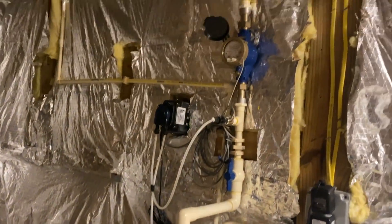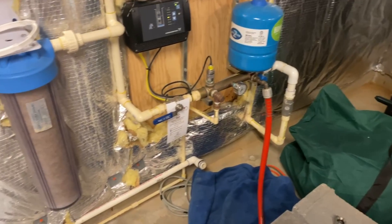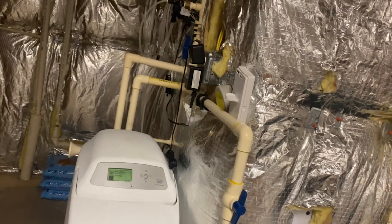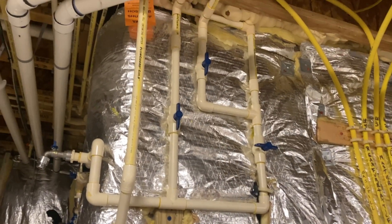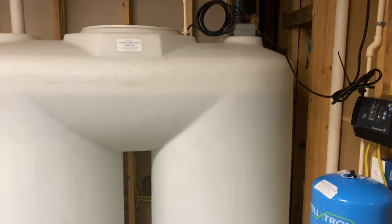We see all of our treatment right here. The water is going to go through these pipes, up over to the other side and into the storage tank. Storage tanks are a good idea because basically it makes it where your lower yielding well can actually run a little bit over a longer period of time, and then you don't really see any kind of service disruptions in your home. Generally these tanks are going to be about 300 gallons.